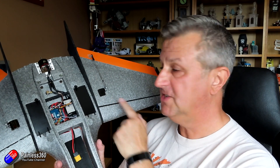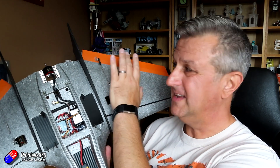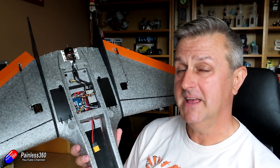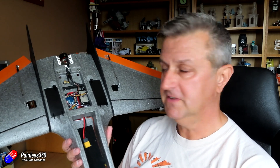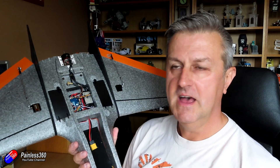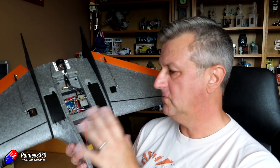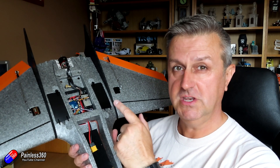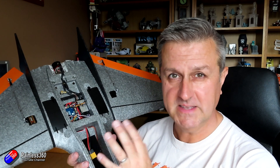I know I'll get questions about this. I've put the servos in exactly the same position as I did for my MiniDRAC, which flies beautifully. You could actually put them at an angle to put them exactly in line, but to be honest the amount of throw you need on these control surfaces is so small — about 8-10mm on something like this. The control surface is huge so you get a lot of responsiveness, so having it like this isn't particularly tricky. Let me go onto the bench and go through my thoughts on where I was thinking of putting everything, because the thought process is the same whether you're doing something like this or building something else with iNav, GPS, and other bits and pieces.